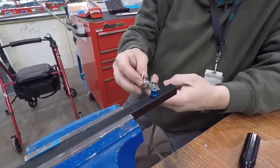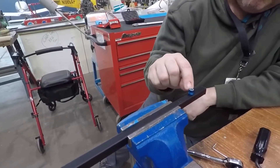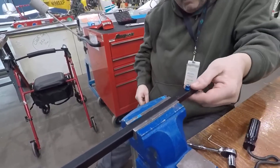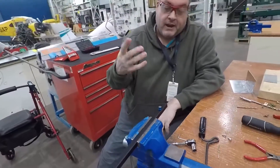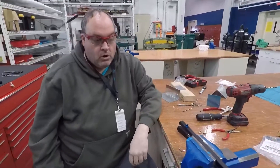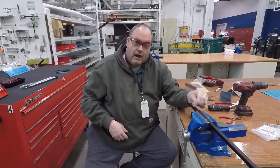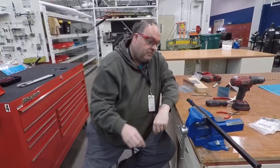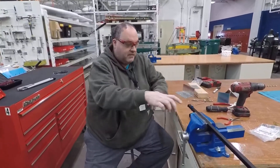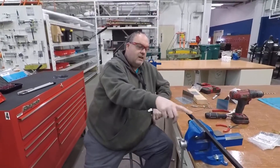Here's where it broke off right there, and there's my Allen wrench. Now, this one I would have normally wanted to use a little different grip length — you'd normally want about two or three threads showing out the top of the nut part. So this isn't the right size Highlock for what I've got here, but I just wanted to show how that works and how it breaks off. To remove it, you can cut it off — most people just take a vice grip, hold on to the nut portion, and use the Allen key to take it off. Everything was done from this one side.